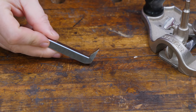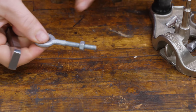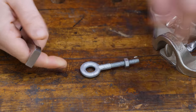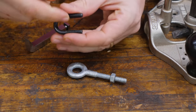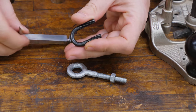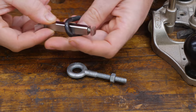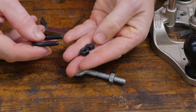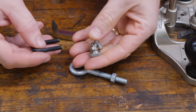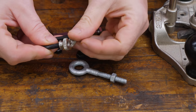Next up we need a way to hold the iron, and normally that is done with an eye bolt, but in this case I want to have a depth adjuster behind it so we can't use an eye bolt. So we're going to use a U-bolt — this is a three-quarter inch wide, so there's a three-quarter inch gap between the legs. This will lock it in place and bolt it against the back of the plane. Normally it comes with standard nuts, but I'm going to upgrade these to thumb nuts so you can adjust it easily.